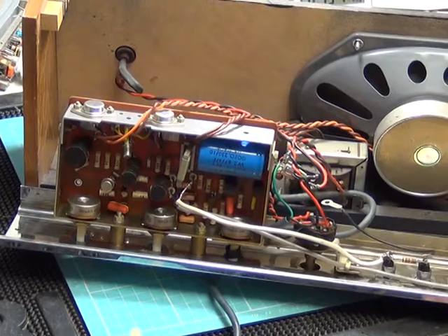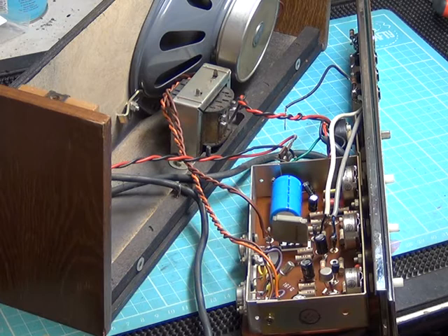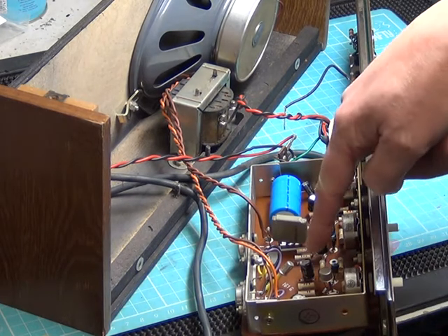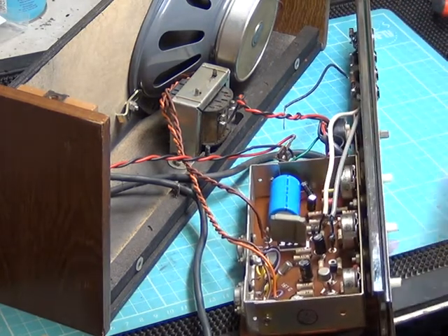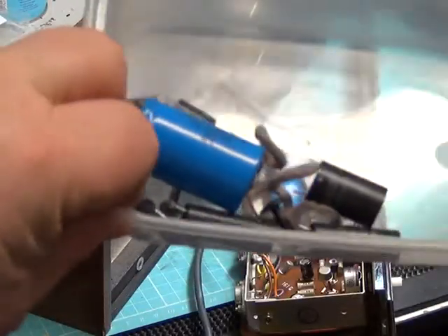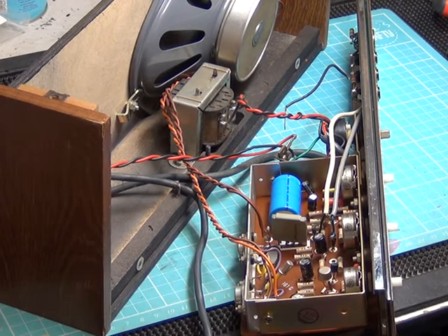Right, so get those changed. As you can see, it's got all new capacitors in there — I'm sure Mr Chippy will point them out. We've left the selenium rectifier in there until we've actually tried it. We ended up changing that for a modern silicon one, if you remember, in the ultra we did. Here's the tub full of horrible capacitors — we'll put those on the ESR meter later and see what they say.